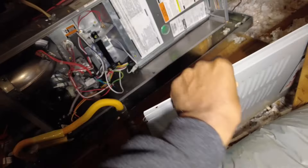I'm going to try this Testo 510i. Going to go ahead and screw in the cone and insert our probe. Make sure it's all the way in past the second wall and come back about two inches or so.